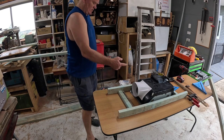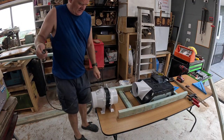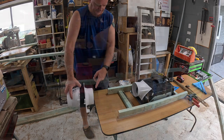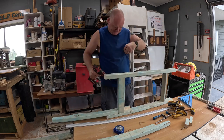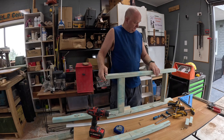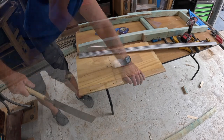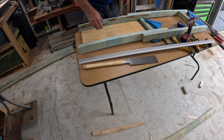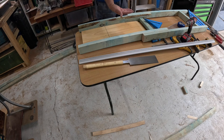That will go in the ceiling somewhere close to the vanity, I'm guessing. Then the fan goes somewhere off over here. It should be a meter, maximum of a meter from there to there. And repeat on the other side. Perfect. Now I want to lock that in there, flush with the bottom of these. I don't want it under these, because the plasterboard will be going on these, so that has to be flush with the bottom.